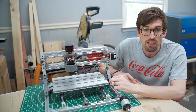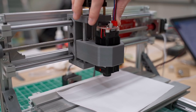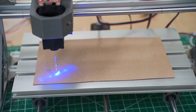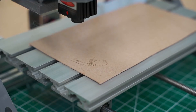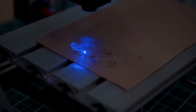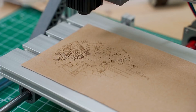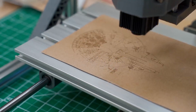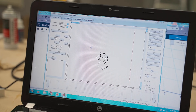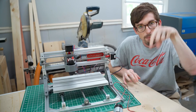Let's talk about the laser portion of this — this is actually really cool, I didn't even realize it was coming with the machine. This is a 2.5-watt diode laser as opposed to a CO2 laser, so it's a lot less powered as a result. You can do a lot of engraving with this, and actually some cutting — mostly with paper. You're not going to cut through quarter-inch plywood. With software, it comes with its own software. The way it's set up, it basically moves over to a spot, shoots the laser, moves up to a spot, shoots the laser — almost like a dot-by-dot pattern all the way across.